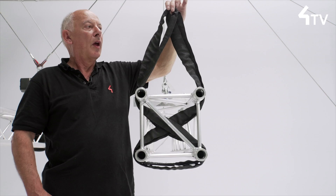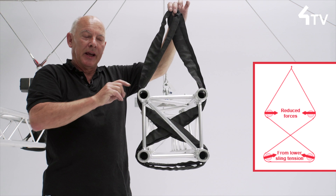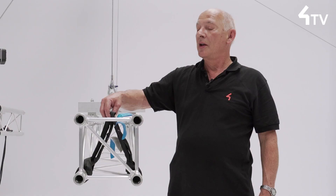Of course, a smaller angle reduces tension in the sling and therefore the compressions on the truss. But now we have lost some height. So perhaps the best solution is to use two separate short slings choked like this, or possibly a purpose-built lifting bracket.